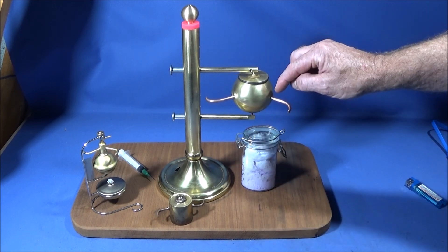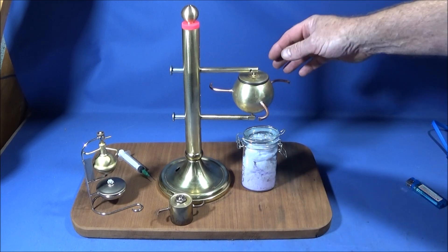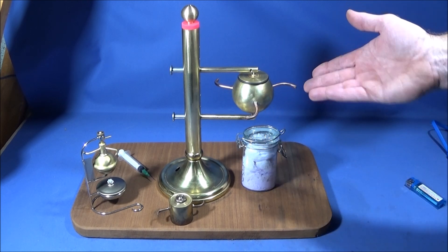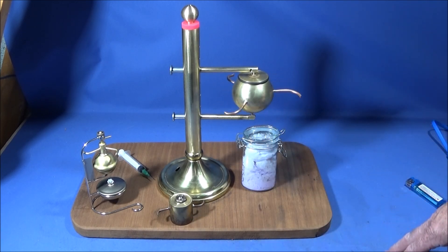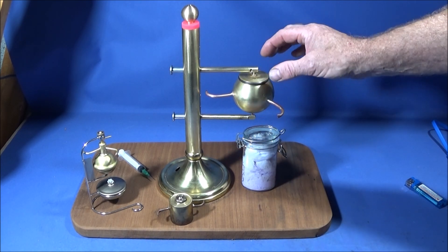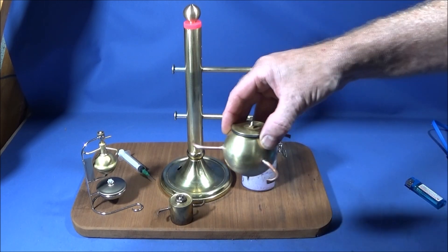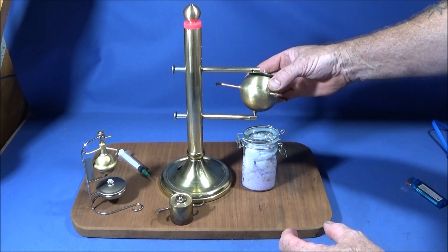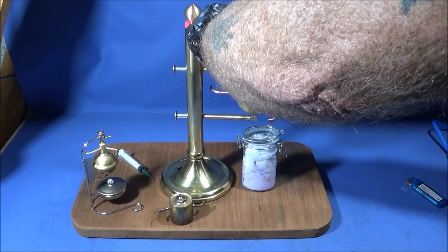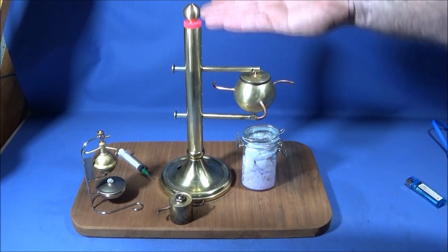Silver solder must be used on these connections here — if you use ordinary solder it will actually break or melt when it's in use. Another important requirement for an engine of this type — this Heron or Hero engine, some people call them — is that they start up without any pushing or prompting in any way. I used a very small round-nosed milling cutter to put a couple of indents in the bar here, and it's long enough so I can just bend it up slightly to take the engine out to fill it up. One of the main important things with these engines is to get a really good free movement with the actual bearing.